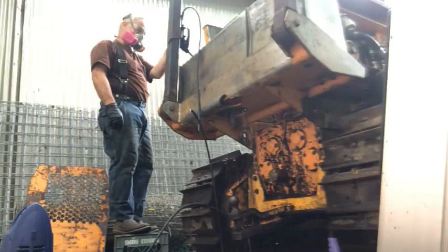you can see a little U-shaped crack right there. Right there at that little U-shaped crack is where it is leaking, so I need to seal that up. Well, POR makes a tank repair kit. They have a 3-treatment system: a cleaner, then an etching agent, and then the POR treatment. It's basically kind of a paint, kind of a silvery looking stuff.